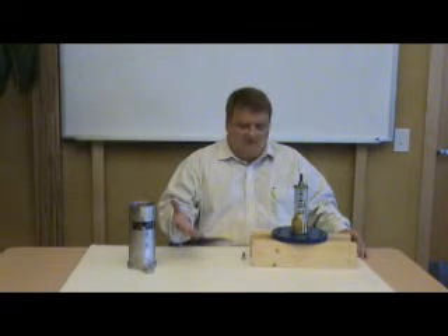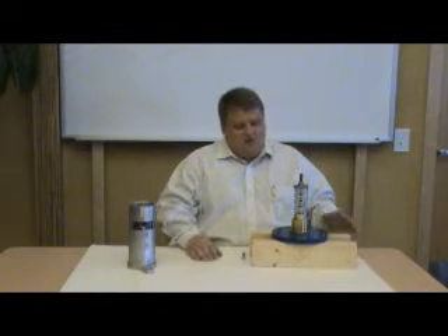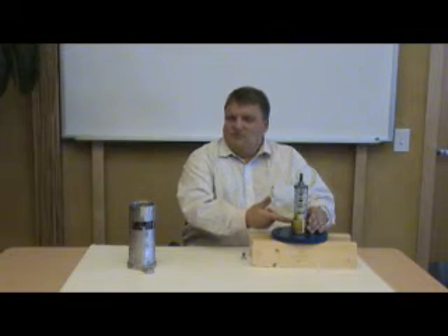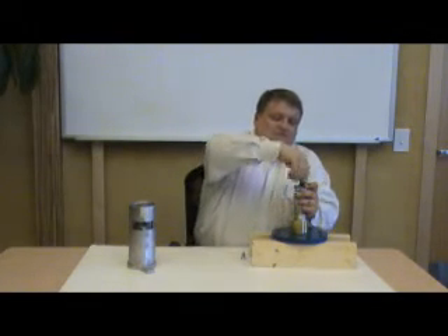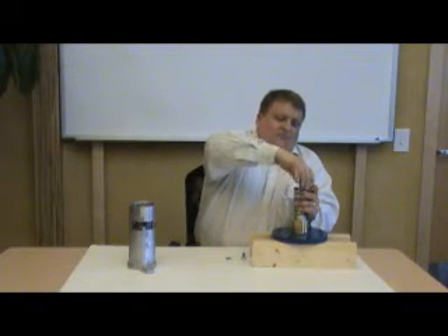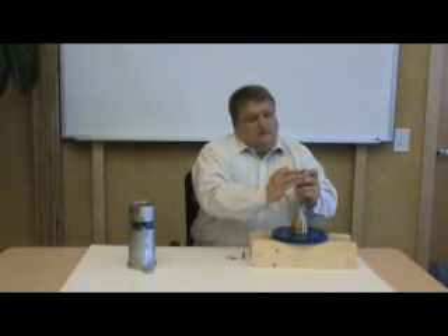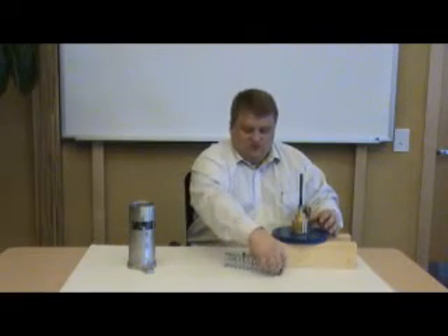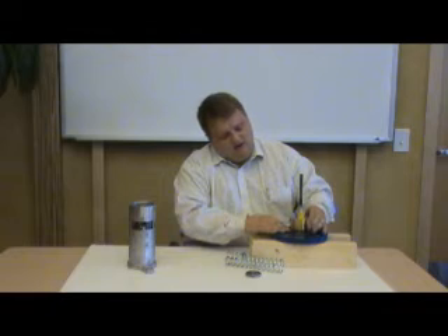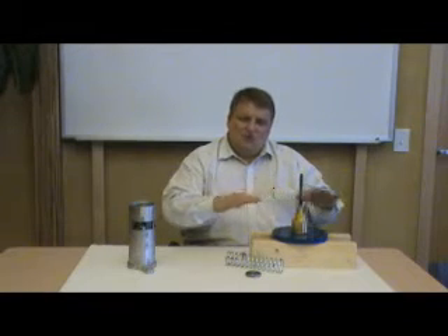Not with a weight-loaded valve, because that one will pop and your air column might actually sink and you might create a pipe load. What we've built into our valve is a small relief shock dampener. Put the spring aside and here you can now see the smooth action of the valve and the built-in shock dampener. Very smooth, and the faster the pressure rise, it will resist the shock and then smoothly let the air out.